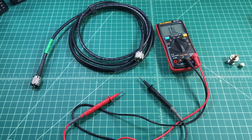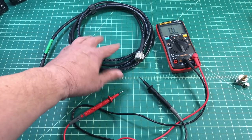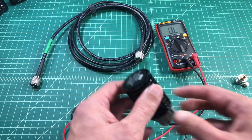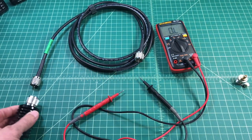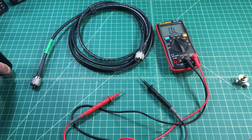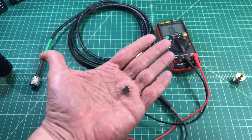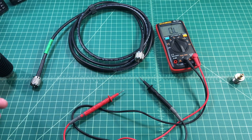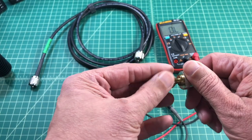If there was a short we would hear that beep again. Now the last thing I want to do is a test of the entire cable. One of the things you can use is this dummy load, which is what I used the other day, but I don't have the connector to connect this cable to it because it's in line with my antenna system right now. So what we're going to use is a 50 ohm reference standard — it's basically a dummy load but it's a 50 ohm resistance.